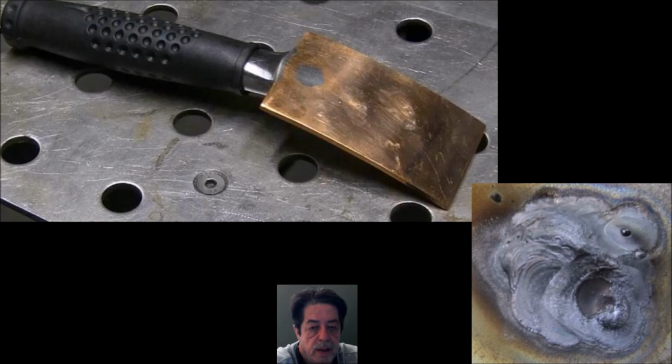My advice when you do this: everybody gets carried away with wanting to hurry. You kind of need to tap the brakes a little bit. Slow down when it comes to welding. Make sure that you're comfortable and that you've got the right wire. You've got wire speed control. If you think it's coming out too fast and that's forcing you to go too fast, then slow it down. Practice your welds and stay consistent. In a very, very short period of time, you can compare what you originally did versus one you did 2 hours later, like I mentioned in another video. You're going to see a huge improvement just by understanding how to use the controls on your MIG welder. Okay, that's it.